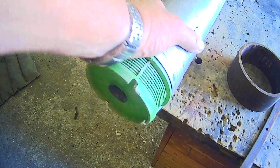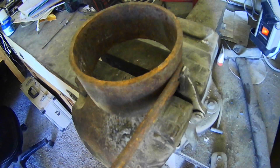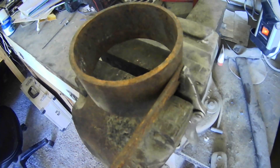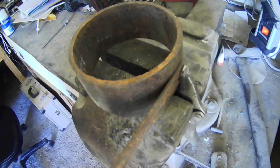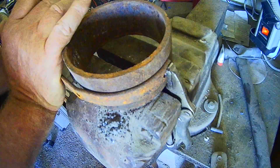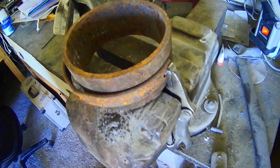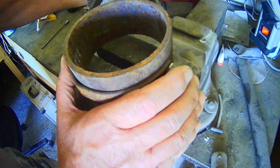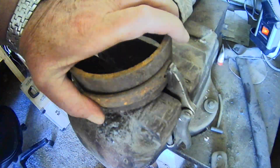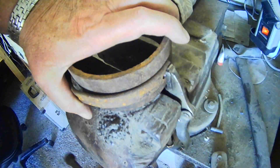So that's the plan for today, let's see how we get on. I've got my little die set up in a vise, clamped in there with a pair of mole grips, and that's actually clamping my piece of steel to it. Now I'm going to bend it round — I'll just have to beat that a little bit where the holes have been drilled because it is a bit of scrap. I go most of the way around, then take it out of the vise and swap it round as I haven't got much room around this vice.